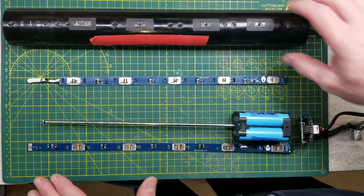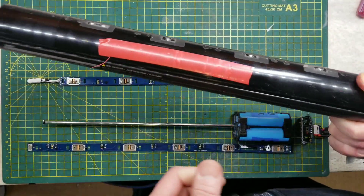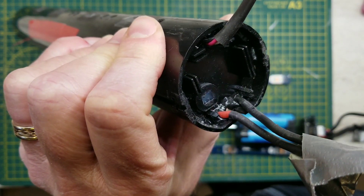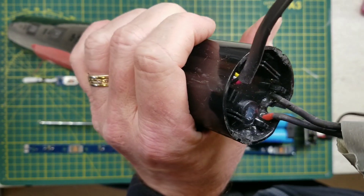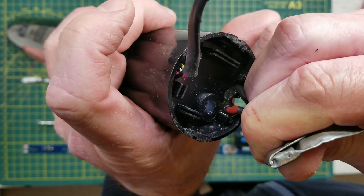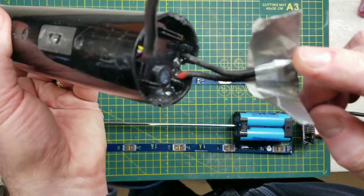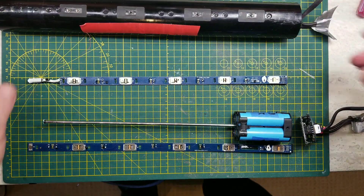I'm going to go a little bit out of sequence here. The contributor of this battery pack color-coded it red, meaning it's fried. And remember that flashing blue light on the other unit? Right there, it is not flashing blue, so this one is potentially dead. You're also going to want to check the voltage. I've shoved a voltmeter in here and established there's little to no voltage coming off this — though that doesn't mean there's no voltage in the pack, just that there's no voltage coming off the charge board.